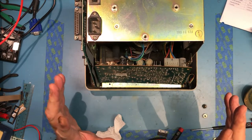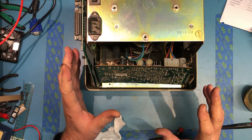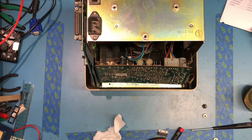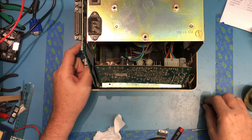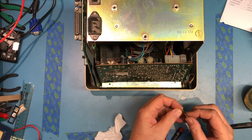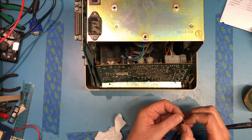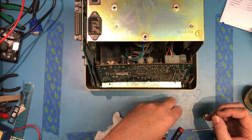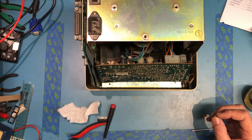This is a good reminder of why you take pictures from every angle - lots and lots of pictures before you tear something down, because it gives you a good reference. It's been a couple of weeks since I've been inside of the unit and I can't trust an old man's memory. The photos are obviously really useful, especially for the high voltage lead to the CRT, to see that it was routed up over the top of the CRT - which is actually the same way I've got it in place now. That's a good sign.